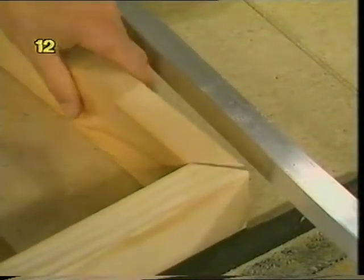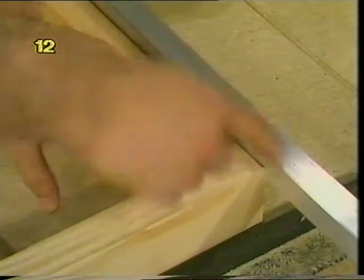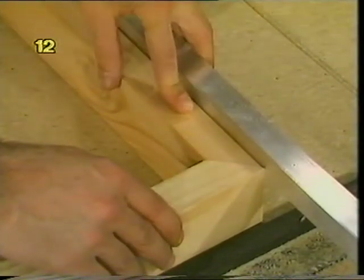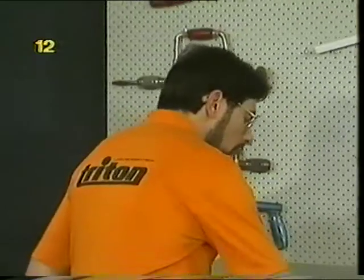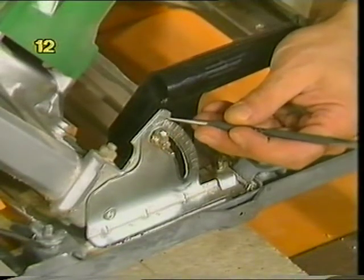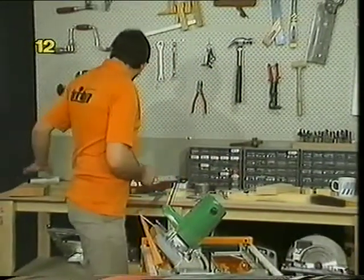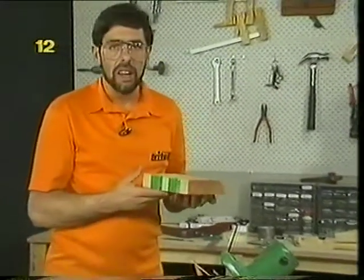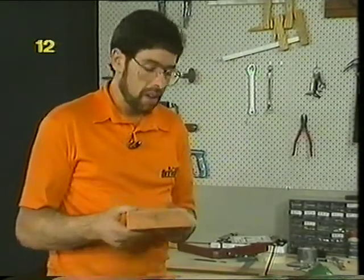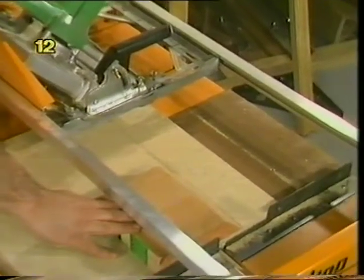Once you've done your finishing cuts and you're happy with them, you can use the aluminium bearing channel of the Triton and the work stop to give you a right angle and check that the pieces are exactly square — touching all the way — or use a normal trisquare. Once you're happy with your true 45-degree position, take your scriber again and make a little mark at true 45 for future reference. Alternatively, the saw blade height-setting block you made earlier could just as easily have a bevel cut side, so you can use that as a setting block to get your saw blade angle absolutely correct.